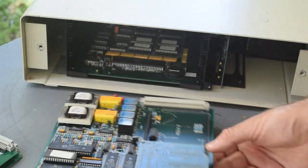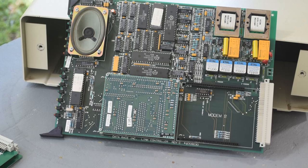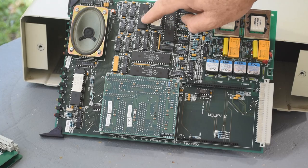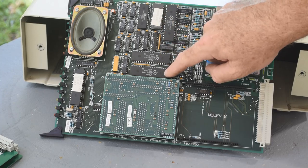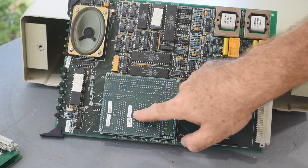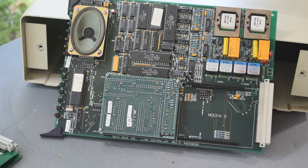Third board here — a little busier, but this is another complete Z80 system: Z80 processor, EPROM, 32K RAM, two SIO-0s. This is the modem — it says modem 2 over here and modem 1 over there — so part of it is the modem, but it's still a complete Z80 computer. Who uses a modem anymore? I can just use it as a computer.